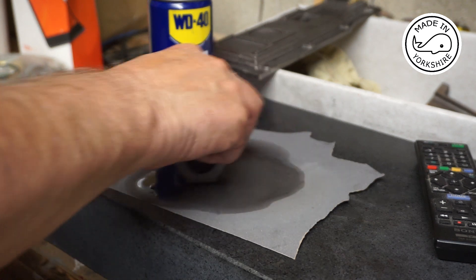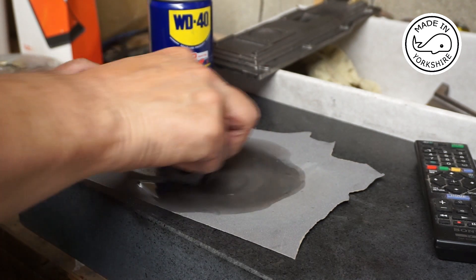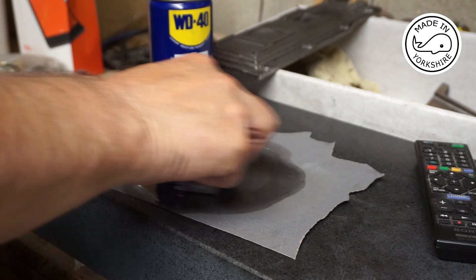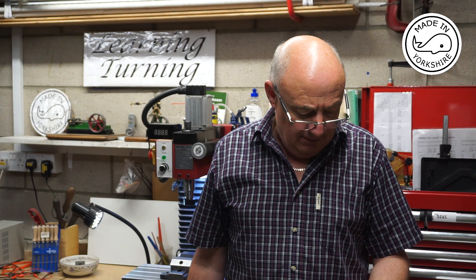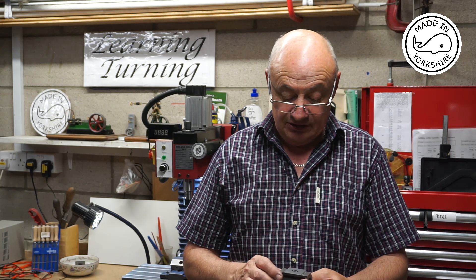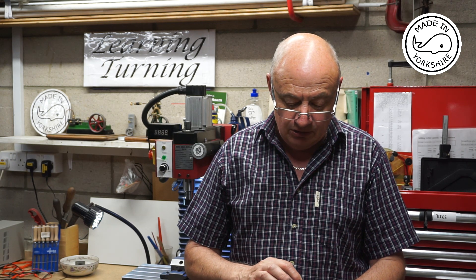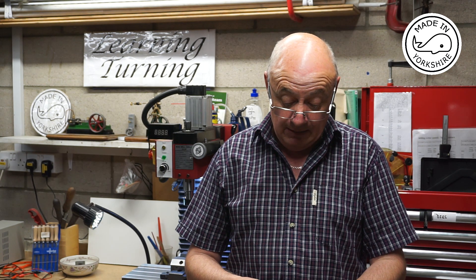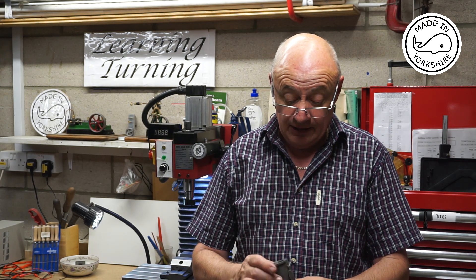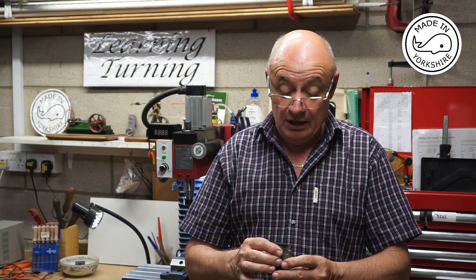I'm just cleaning the port face up on some wet and dry. Well, that seemed to go okay. It's a real bonus not having to drill those steam passages — that's a really stressful little job. I'm going to hold fire at the moment on drilling and tapping any holes until I've actually made the cylinder covers and the valve chest. Anyway, I hope you like the results so far, and in my next video I'm going to have a go at making the two cylinder covers — I hope to see you later.